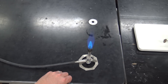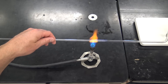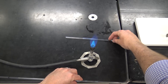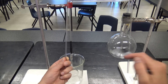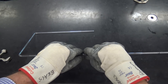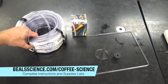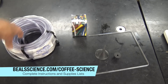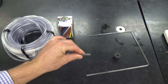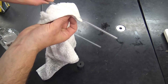We heat the tubing so we can bend it — I just want two right angles so I can go from the Florence flask, the one with the round bottom, over into my other beaker. Then I need to cut it to size, so I've got a glass cutter here. This just scores the glass. I put on my glass gloves and snap — there we go, I've got it to the perfect size. Heating up the ends smooths them out a little bit. This is the tubing I need to attach things together — it's one-quarter inch inside diameter. I've got some heat shrink tubing, a glass funnel that I've shortened, and then a number six stopper with a hole — that's a 6-1. To fit the stopper, I'm going to add a little bit of mineral oil so it slides in easily.